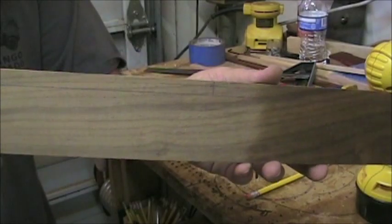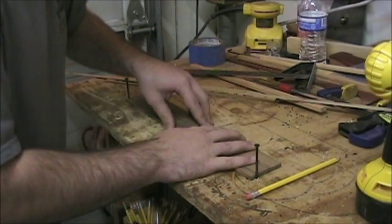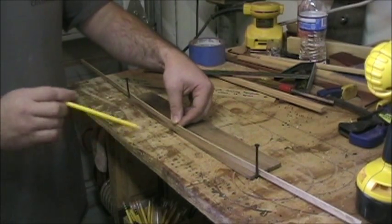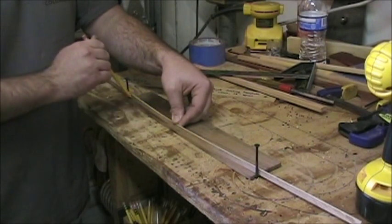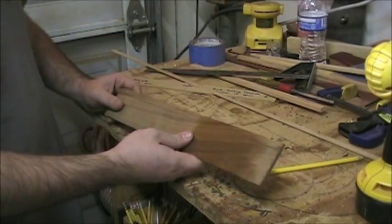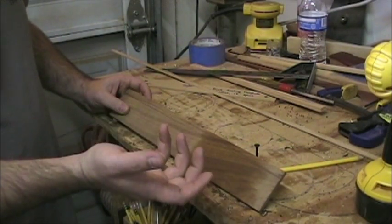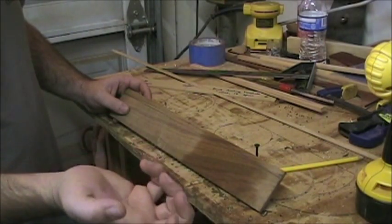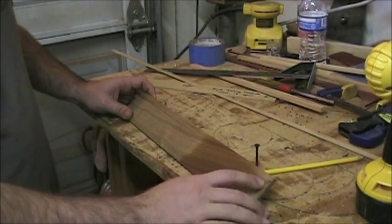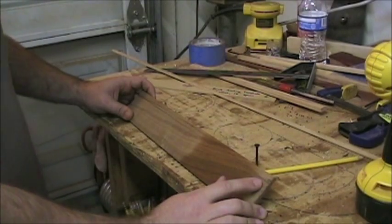You get it drawn on there, and now you've got this nice graceful curve that goes from the end point all the way up to your quarter inch and nice and evenly down to your other end point. Line it up so the lines are on the bottom of the screws, put your piece on here nice and lined up straight, push it out to the quarter inch mark, and then come along and put yourself a nice good mark that you can cut to. To get this thing rounded off, clamp it down and come along with a saw to take off the majority of it, then come back with either a block plane, a scraper, or sandpaper wrapped around a nice square block and refine this curve so it's 100% matching to the line. Because you're going to use this to make all your braces from now on, take your time on this one and make it look good.